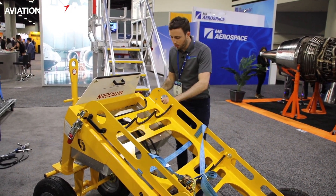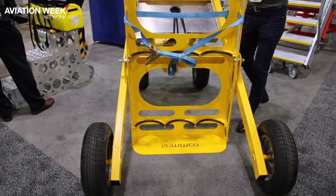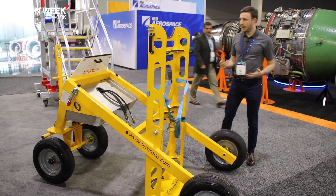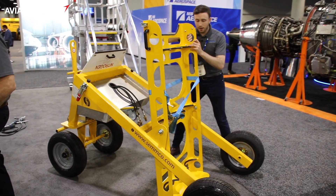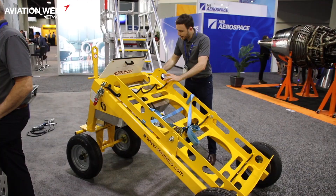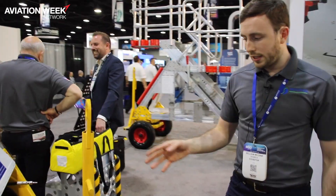When we designed this platform, we really wanted to think about the engineers' backs and stop them lifting things. So we've got this cradle that lifts up 90 degrees and locks off there, so the cylinders can be rolled on and off very easily, preventing that manual handling issue. Once the cylinders are on, fold the cradle back down — it releases the brake on the bottom of the cradle, comes back onto the wheels, and you lock it off on these clamps on the side.